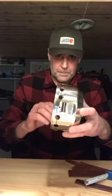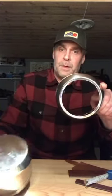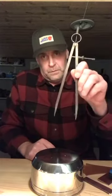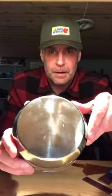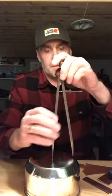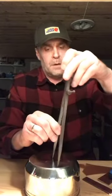Now there is one more hole to do — the big one in the top. You start with this lid piece and need to find the exact center point. You can do that with your tape measure by measuring across. Once you find the center point, press your center punch hard and you end up with a small dent. After that, use the compass or divider and set it to leave approximately 10 millimeters in from the side, then make a circle mark all the way around.